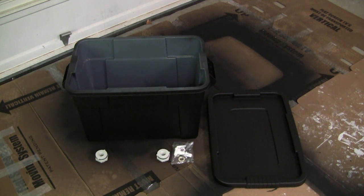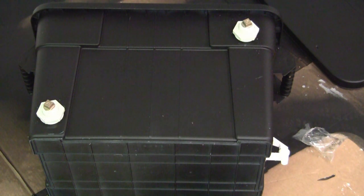We will also place a small faucet on the side because once we've heated the water up, we will need some way of getting it out of the bin. So we'll go ahead and put those 3 fittings on now. Here's what the bucket looks like with the bulkhead fittings and spigot attached. Notice I have some plugs in place because I'm going to go put this out in the sun, fill it with water, and see how much it actually heats up.